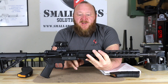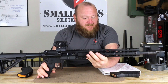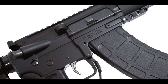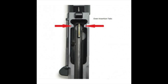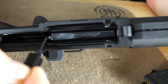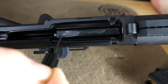Taking a look at the feed ramp, you're going to see another area where the Gen 2 made an improvement. On the barrel extension, instead of having the standard lugs that go all the way around, there's only one lug where the feed ramp is, which makes it much easier and more reliable for feeding — it doesn't have anything it can catch on. The upper receiver is proprietary to the KS-47, 7075 T6 aircraft-grade aluminum. We have a standard charging handle, standard forward assist, a fired cartridge case deflector, and an ejection port dust cover. Looking on the inside, you can see magazine stop tabs, which prevent over-insertion of the magazine and ensure the magazine is straight. One of the issues with these rifles that utilize AK magazines is that the magazine does not sit properly — the back end sits down too low, causing the locking lugs to either miss the cartridge or grab incorrectly. This ensures the magazine is properly inserted at all times.